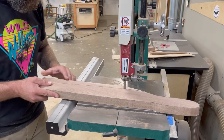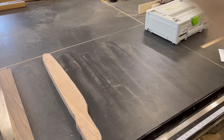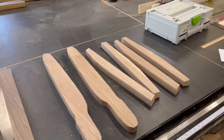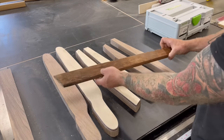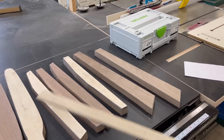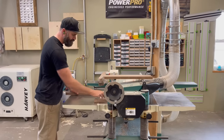When I traced these out, I used a Sharpie marker because it gives a nice fat line, which means I can cut right on the outside of that line and know I haven't cut too much material off. You want to cut as much material as you possibly can, but not so much that you go smaller than your end piece. After cutting out all these pieces, I decided I needed to make another template for the middle stretcher — originally I thought it was just a straight piece, but looking at it closer, it had a pretty good taper to it. So instead of doing a taper jig on the table saw, I just went ahead and made another template for that middle stretcher as well.